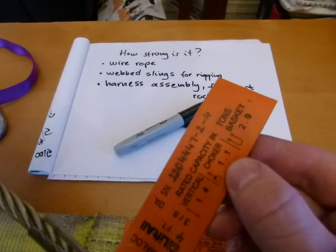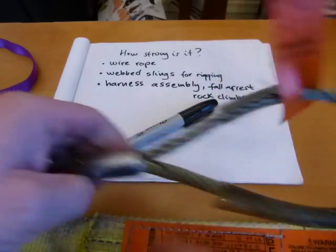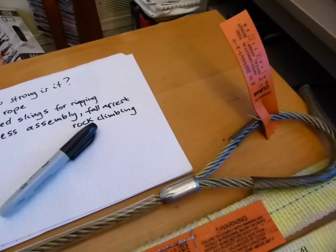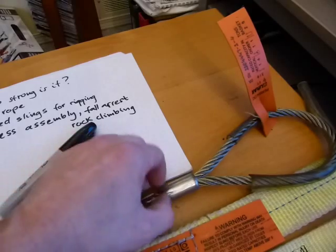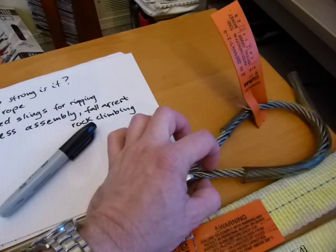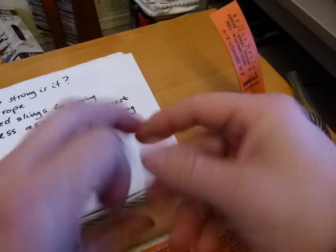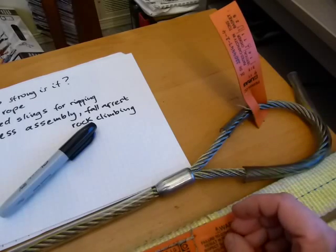It's a little weaker in a choker hitch and stronger in a basket hitch configuration. However, what if you don't have a tag on it? If it's lost, well — wire rope is a composite product. You can't just measure it and call it done. It does matter how many pieces of wire make up the rope, in what weave and lay they're braided together, what kind of clips are used, or how the loop is woven in and fixed — that also affects the strength of the finished wire rope with a loop on it.